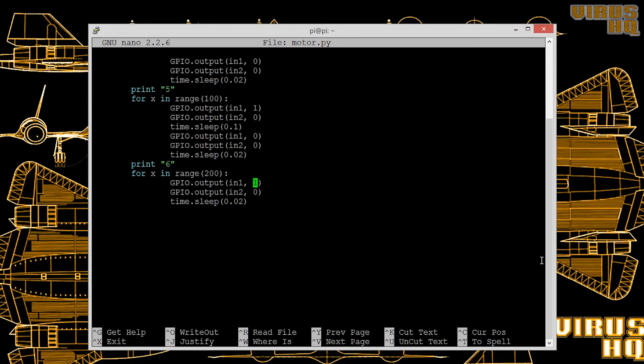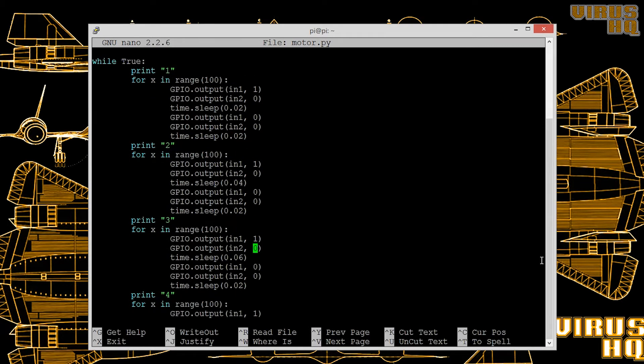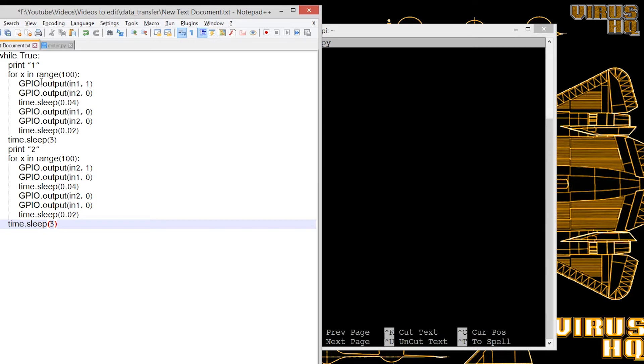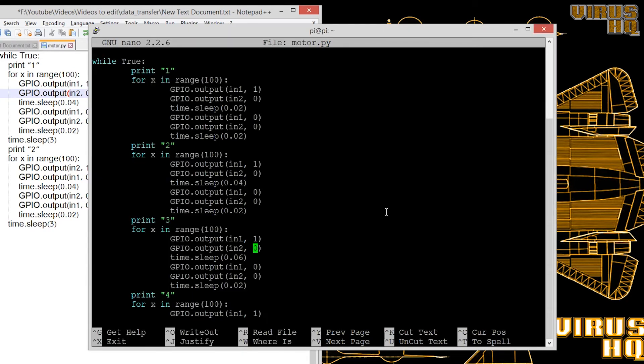This was controlling the motor in one direction only. To reverse the direction, I set a duty cycle, then set the inputs for the clockwise part to input 1 = 1 and input 2 = 0. Then I simply reversed the inputs — where input 1 was high and input 2 was low, I changed it to input 1 low and input 2 high. This simple change in the inputs reverses the polarity of the motor's rotation.